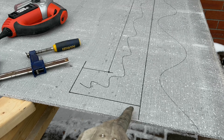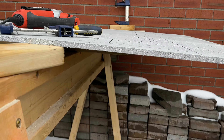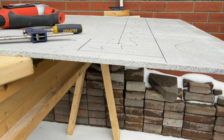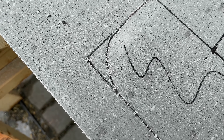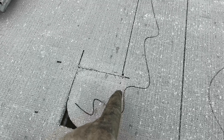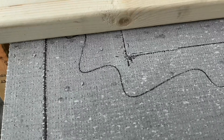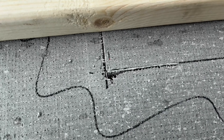Next I'm going to follow this line and then put a board on there. I've made sure that my line and my boards are out of the way. This Diablo blade cuts just as well as a regular jigsaw blade — this is fantastic. So this is all cut out. Now I'm going to put a board in here and lock it down so I can follow that line nice and straight. Before working down this line more, I went back and squared off this corner, so it should be all good now.